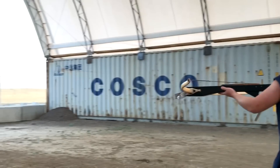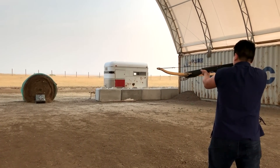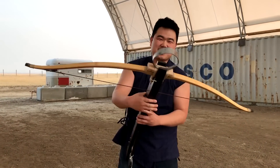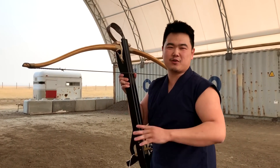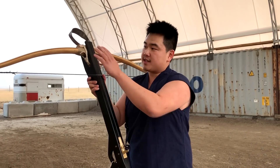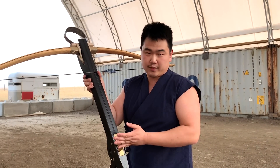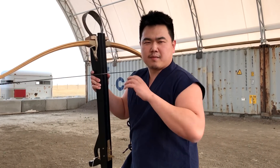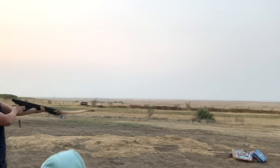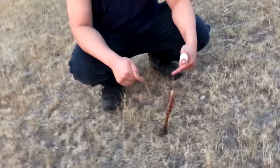Wow — that is satisfying! So this first prod is only 100 pounds at 23.5 inches, and it's not even designed for a 23.5-inch draw length — it can actually be pulled to 30 inches, so it's not fully efficient here. I previously used it just to make sure the crossbow works. We will test it with a much heavier prod in the future — stay tuned. We found the bolt; the arrow traveled almost 300 yards, I think.